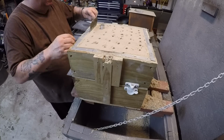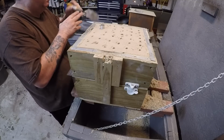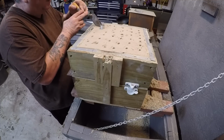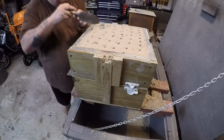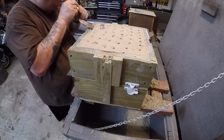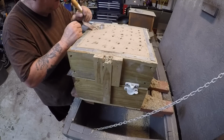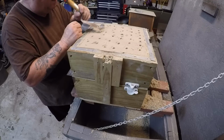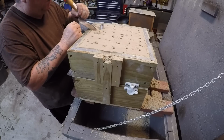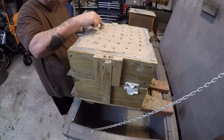So when it comes to these, they can be cut. Actually, I did get, no, I'll use this. Cut a pouring basin with an angle, so that you can hit the angle where you need to pour your metal. You don't pour your metal straight down the hole, okay? Because you're guaranteed to generate dross then.